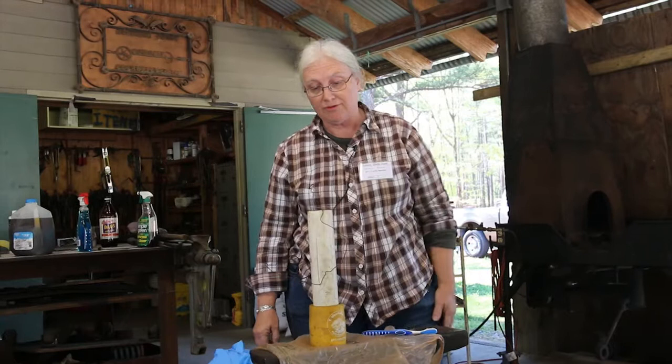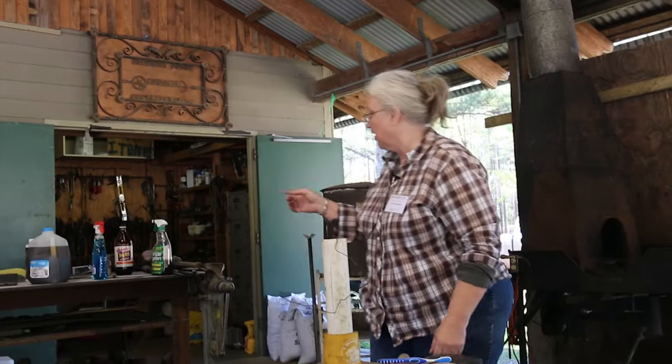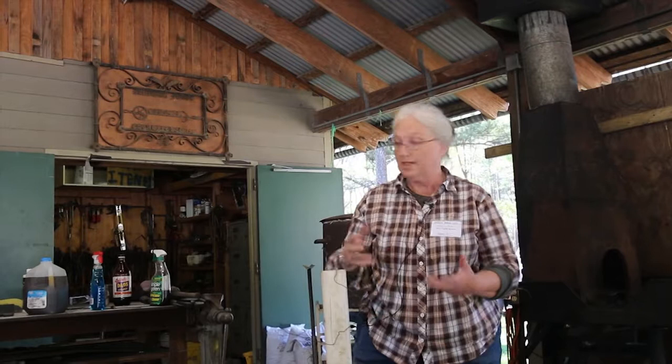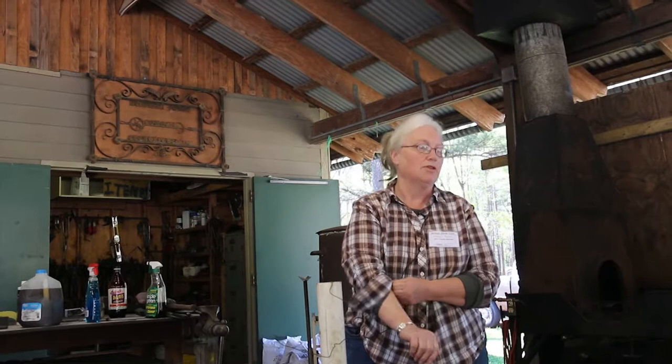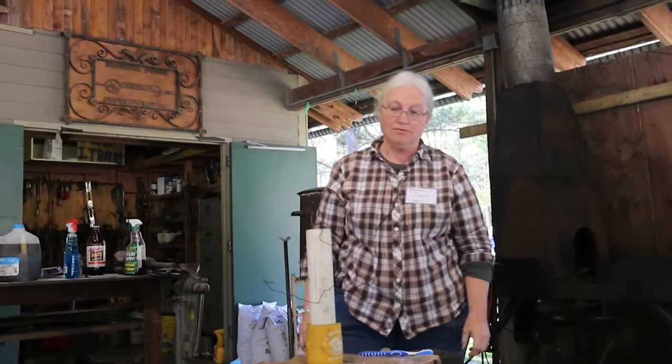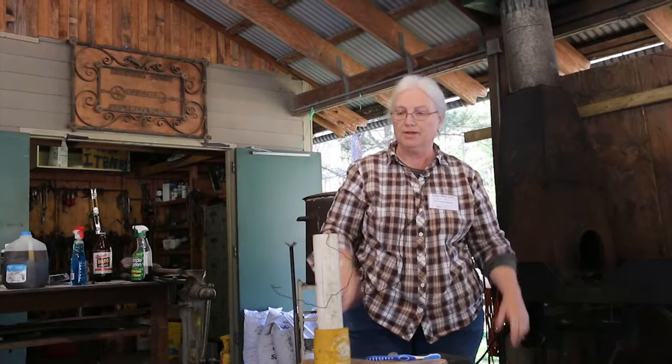So we haven't been putting that deep of an etch on it. After the etch, you take it out and clean it real good. We've got the ammonia. But what we usually have is a 5-gallon bucket of water and baking soda. Baking soda stops the action of the etchant also. That is your neutralizer, baking soda and water. I'm not sure what the mixture is on that; Jerry can probably tell you. But we've got the ammonia today. That'll stop it too. Then we just put it in WD-40 and let it sit there for a little bit to absorb it in so it doesn't rust.